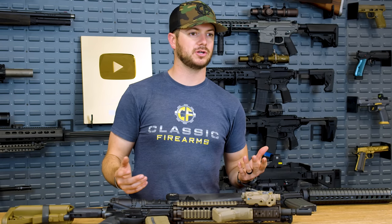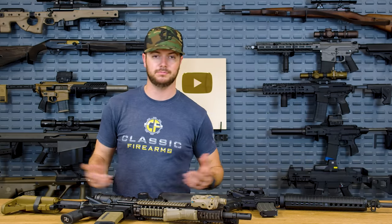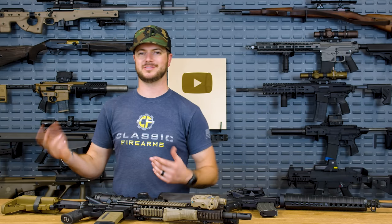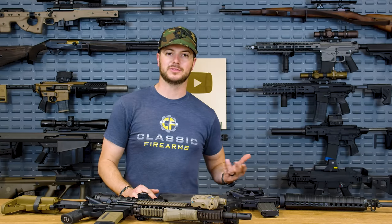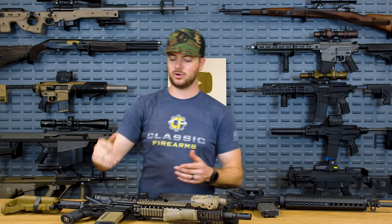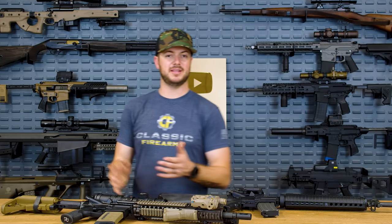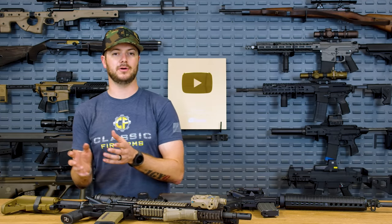You see that a little bit within the AR-10 game versus the AR-15. Thankfully for the AR-15 there is a mil-spec military standard, so you can use this upper and this lower and it's typically going to work just fine. With the AR-10, if you don't have a certain type of upper that matches your lower — and I'm talking about the DPMS style versus the Armalite style — one is a curved upper and curved lower versus one being a little more angled. If you confuse the two and buy a DPMS lower thinking you can take your Armalite upper and throw them together, it won't work.